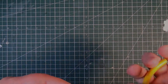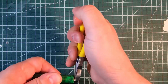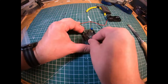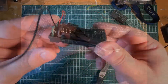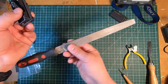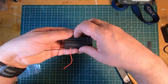The first step is to carefully remove the dead 14650 cells by cutting through the spot welds and then removing them, trying not to damage the circuit board. Then I've got some extra plastic to remove from the bottom of the battery case itself so that the AA battery holder can fit in there snugly. I did have to clean this up a little bit with a file, but removing a little material from the outside edges made it fit in there like it was made for it — a perfect fit.